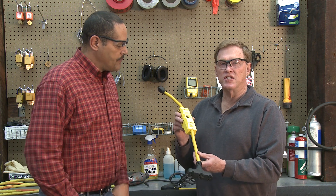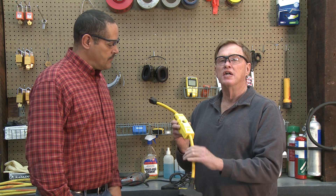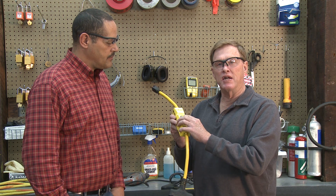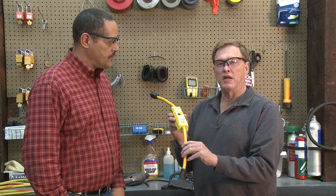Let's show how this works. This is a GFCI. Before you use a GFCI, you should always test it. The best way to test one is to hook it into your source and then hook a tool to the end. Then what you want to do is push this little black button here — that is the test button.